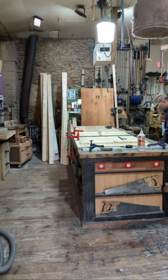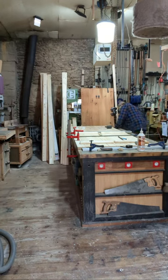These are going to be nailed. They're not going to be screwed. It's just nailed, because these particular shutters will have hinges with bolts going right through the ledges, so they don't need anything more than the nails and the glue.